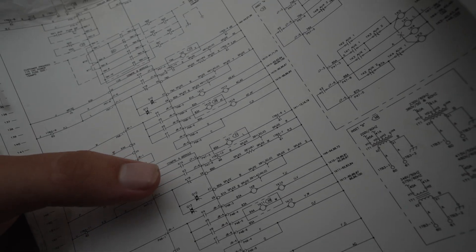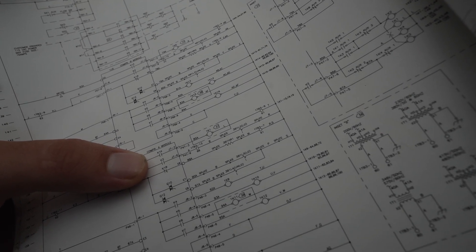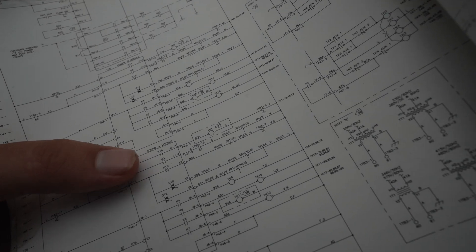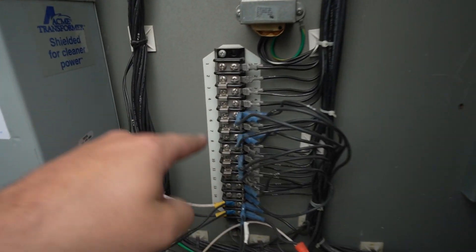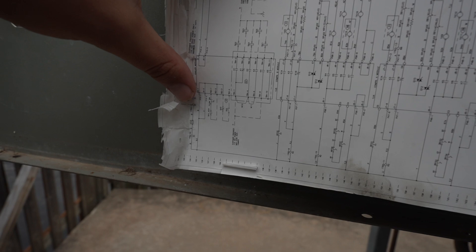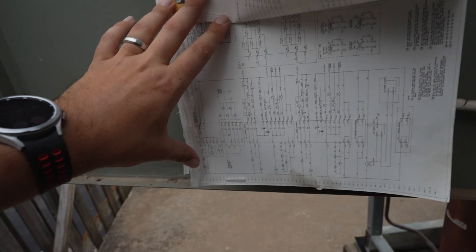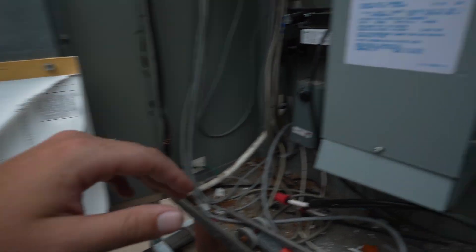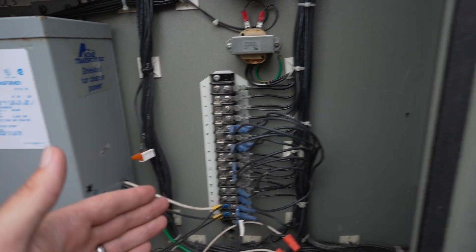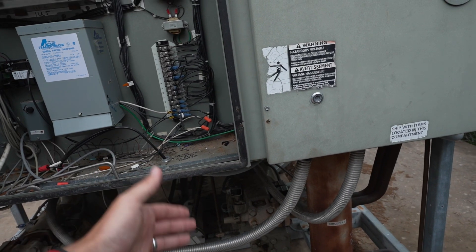Digging through the schematic, I could see that J7 terminal number nine coming out on 88A and B on 1TB3-13 was supposed to be where I was. But when I looked for it, if it's not there it's got to be somewhere — I found it on terminal eight. Terminal eight, which was all the 62-wire terminations, was my L1 feed coming off of my transformer. What that would mean is that it was getting constant power from the 120V side of the control circuit, which is not okay. That explains why it was getting 120V all the time — it's on my 120V bus. So I unplugged it from terminal eight, plugged it into terminal 13, and that's when I lost my 120V to the solenoid and it was able to deactivate.